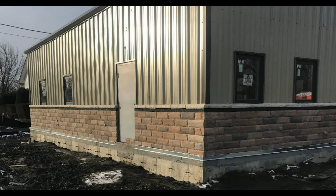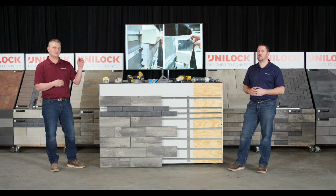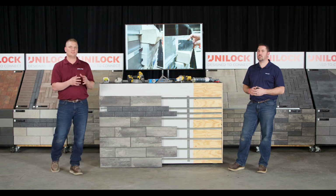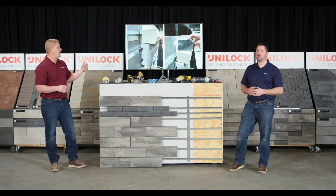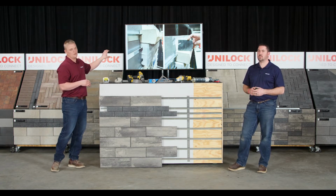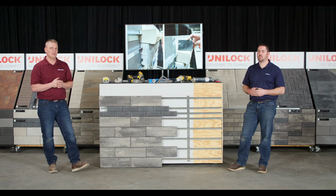Nice glamour shot. One thing I want to point out next is how the ledge stone is mounted. Most guys are either gluing that or setting it in with masonry mud to hold the ledge stone. You can see that the contractor here created a nice template to match the U-Cara track system, and then created a jig within his saw so that he can run the ledge stone through and give it an extra secure point to adhere to the building. You could still glue that, but that extra cut will actually increase the integrity of holding it to the building.